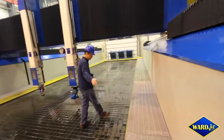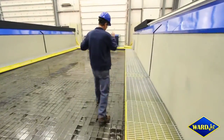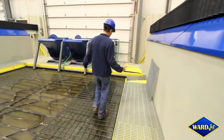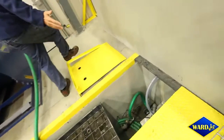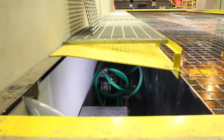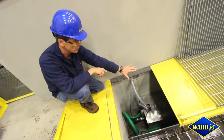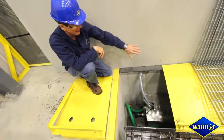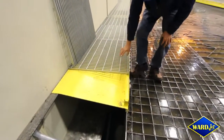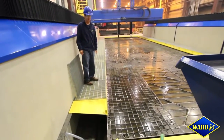What we've got down the sides are two wide alleys. The tank stops about here, and we've got access for all our plumbing and all our abrasive removal. Everything is fully accessible. If you have a look in the gap here, you'll see we are running all the abrasive removal system. We've got access to everything inside this area, so we can turn all the valves on and off without having to remove these covers at all — through these holes, which are opened with a tool you just put in. Any water that comes on will splash off and run into the tank, and then we've got a nice walkway that makes it level with full access without worrying about falling in.